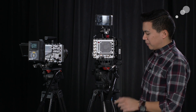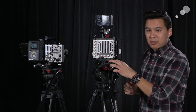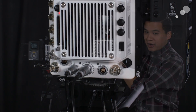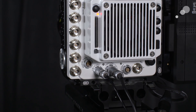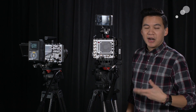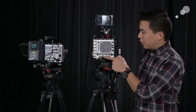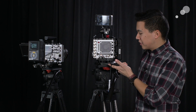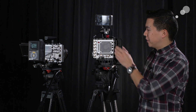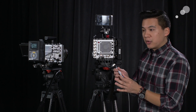There are two inputs here. Because everything has been consolidated into a much smaller body, some ports are dual-purpose. Both are labeled as voltage inputs for power — the one on the right is 12V DC, and the one on the left says 16 to 32V DC input. However, the left port also serves as your remote PCU or RCU interface, so if you want to use a PCU or the Bluetooth dongle, you'd use that port. We've built a custom cable — I'll call it temporary — that takes a 4-pin XLR from a Cameo side plate and feeds power in, with a Y-splitter to also go to the PCU.